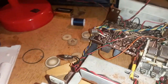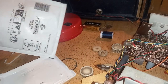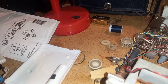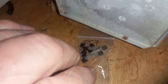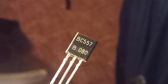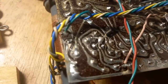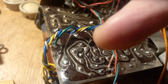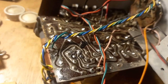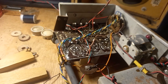I also found on the internet that there is a silicon alternative, which has just arrived today. These silicon devices apparently, nine times out of ten, are a straight swap. I've mounted the transistor into those locations — it is on the wrong side of the circuit board, but that shouldn't be an issue, and it's easy enough when I'm just experimenting at the moment.